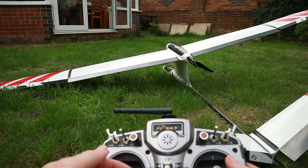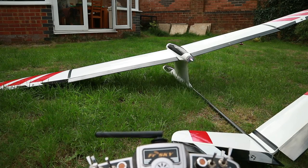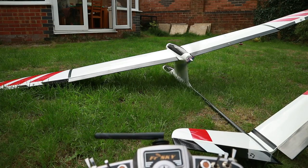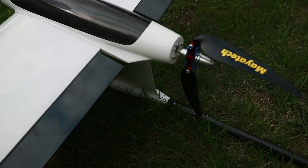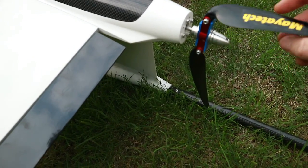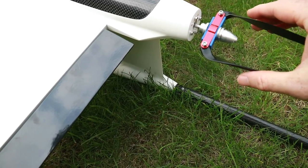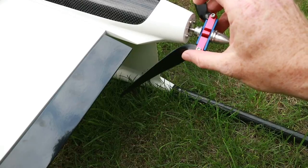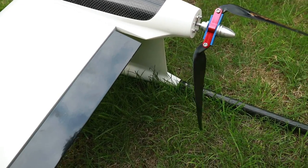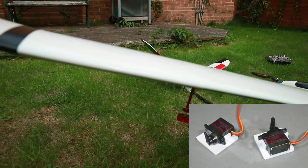We've also got an arm switch — at the moment that doesn't do anything until we arm it — and then there's some vectored power in there. I had to do quite a lot of printed pieces for this. I've made two pieces here to stop the props coming together or hitting anything, so they can't go out that way. Each of the servos has their own 3D printed bit as well.